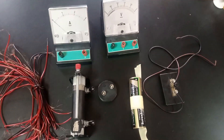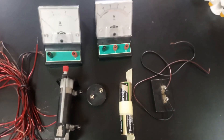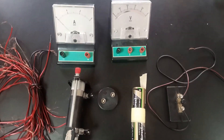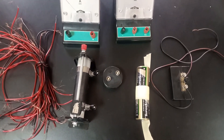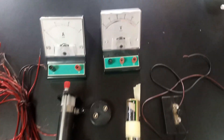The diagram is what we're looking at now and that is how we are going to set up this particular experiment. Before we set up this experiment, we are asked to connect the terminals of the battery to the voltmeter. In doing this we are trying to determine the EMF of the battery, and then we will note it because eventually we are going to use it.